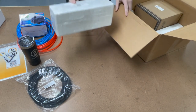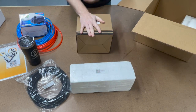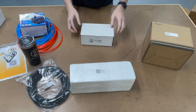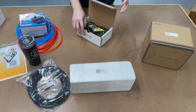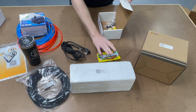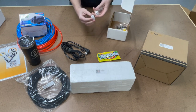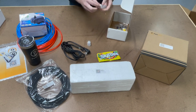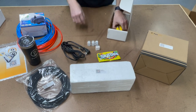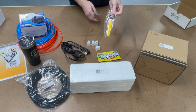Additionally, we've got the actual motor itself as well as the VFD. Next we have a little accessories box which has the power cable, a bag of Skittles, and since this is an ER11 spindle we have a one-sixteenth, a one-eighth, and a one-quarter collet that come with it. We've also got the PwnCNC spindle nut and a 17-millimeter hex wrench.